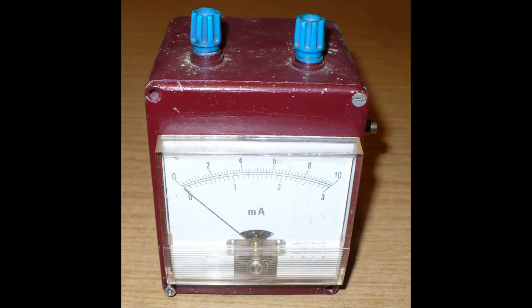This is a photo of the one I knocked up — literally slung together. I'll show you inside in a minute. There's actually nothing to it, so it's a nice little project to build. The meter is one milliamp full scale. Forget the readings — that's irrelevant. This won't read SWR by the way. This will only read aerial current or RF current. It's not calibrated. I use this purely as an indicator.